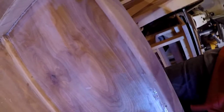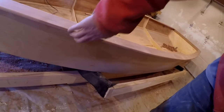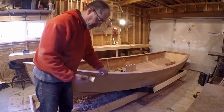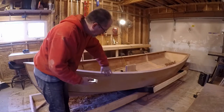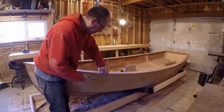You can see there's a sharp line there, and where I've just very quickly gone over it — I'm not trying to change that nice curve that the cutter bit gave us, but just eliminating the evidence of machining. Then a lighter hand sand finish sand over there to clear it up. I can't do that out here because I don't want the edge of that sander to hit our finish. So for this inside edge I'm going to take the plane and do basically a 45 — just take that corner off.